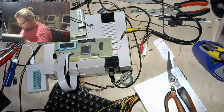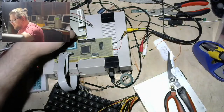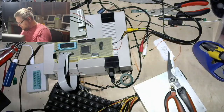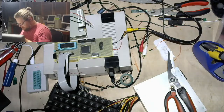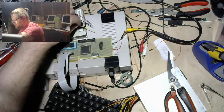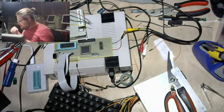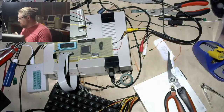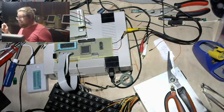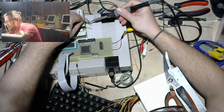Also, there's the whole capacitors deal, which I feel is a common misconception that it's an age thing. Capacitors do age, but the capacitor issue was that there was basically a capacitor blight in the late 90s and early 2000s, so machines made around then just have faulty capacitors that failed over time. So there's stuff like Rifas that are notorious to fail, but otherwise, components in an Apple II or a TRS-80 or an older machine really don't fail that often. And especially on something simpler like an Apple II, because there's not much to go wrong.